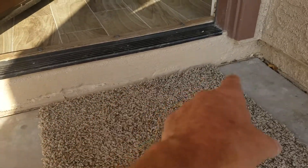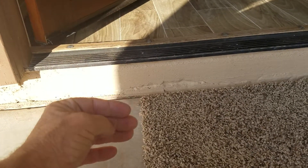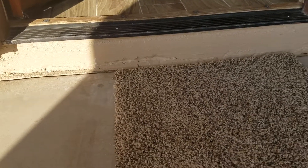This horizontal crack here is where the interior floor was poured out to the vertical face and sits on top of the foundation wall. This is a construction joint, not oxidized rebar.